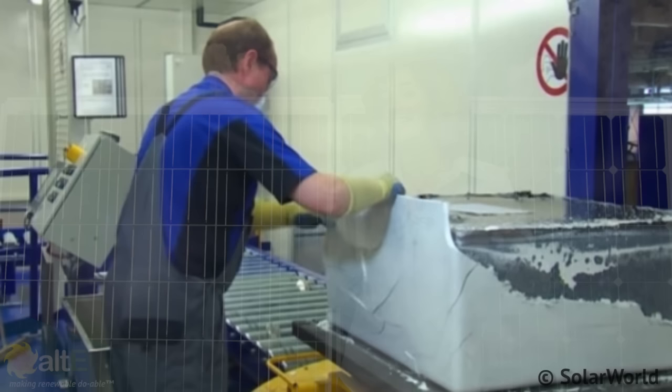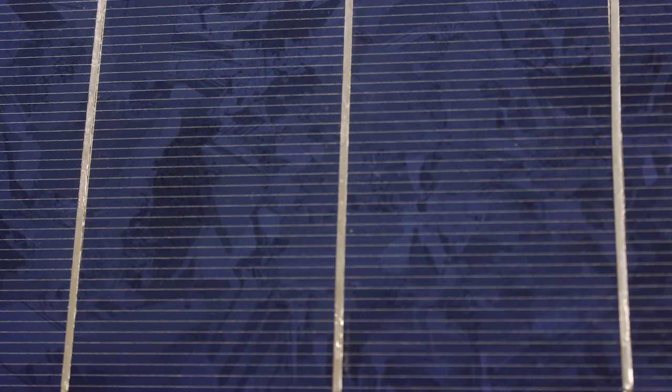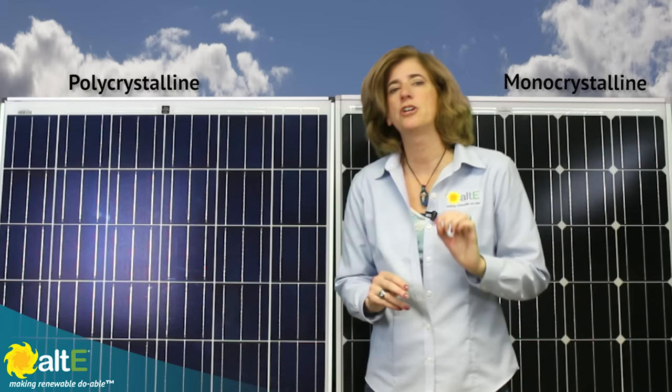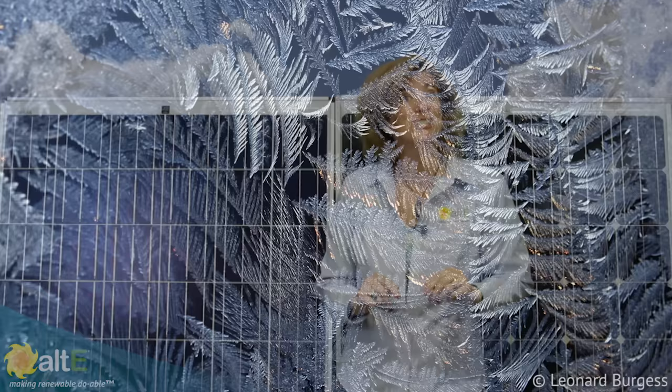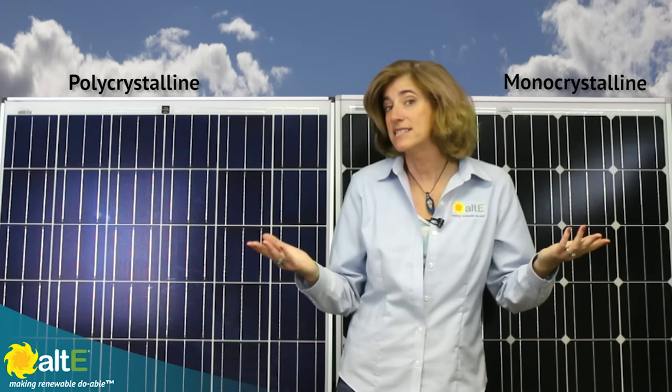It takes about 20 hours to melt, and about 3 days to cool down. The polycrystalline panel has a blue, mottled look, like a piece of particle board — it looks like it's made up of multiple chips of silicon pressed together. But that's actually caused by the melted silicon cooling and hardening, where it crystallizes like frost on a window. When it's sawn into wafers, there's much less wasted material from the square ingot than from the round monocrystalline ingot, and it's a less expensive manufacturing process.